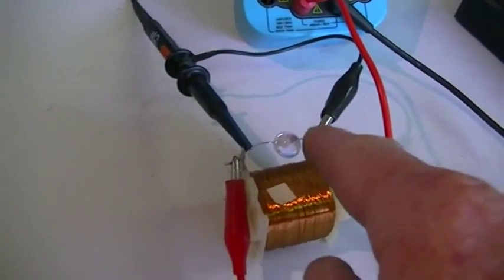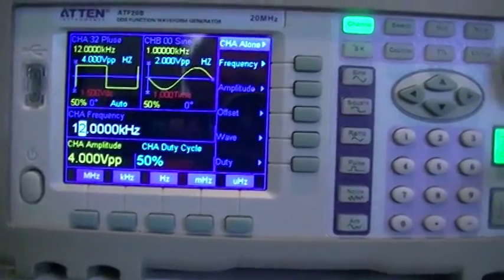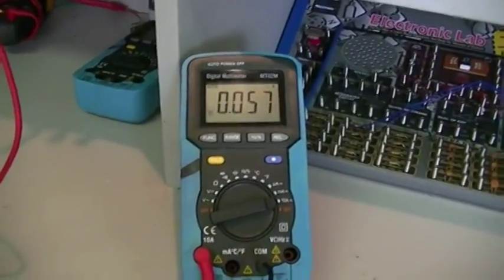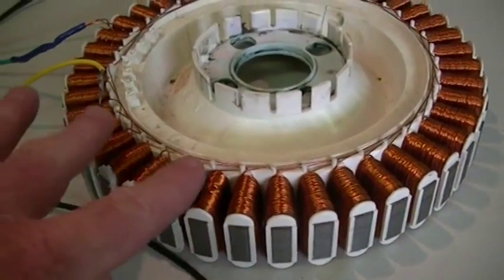My scope shares a common ground, so this side, the negative side of the LED, is also our common ground along with every other unit that we're using here. Our signal generator — I've been mucking around a bit with the frequency. I've got it set on 12 kHz. The more I wind up the frequency, the lower the current draw goes, but the brighter this LED goes. I had to change one because I blew it out when I hit about 18 kHz. We can get that right down to 8 mA. At higher frequencies the neons go out — not enough inductive kickback to drive them. But our LED goes sky high and blows out. As you can see, the laminated core is totally isolated from the windings — no short, it is totally open.